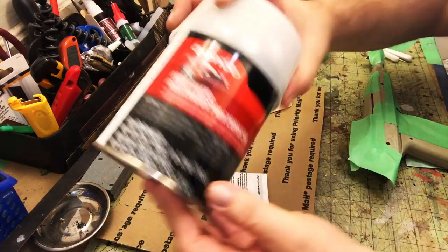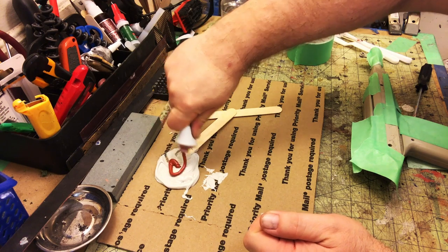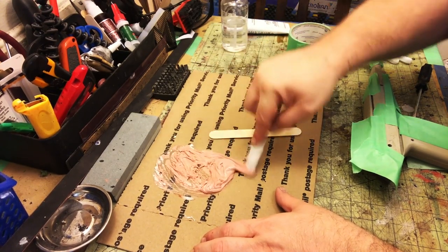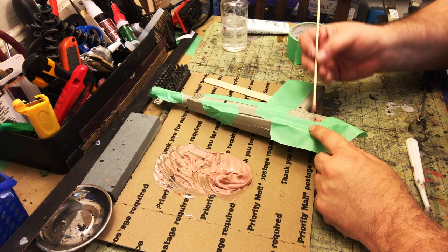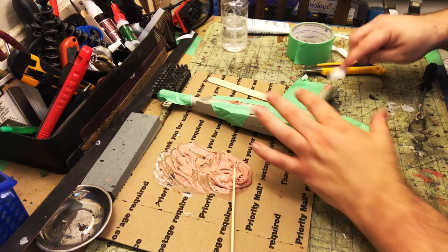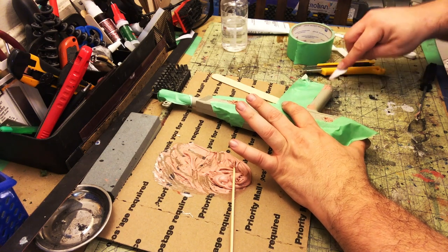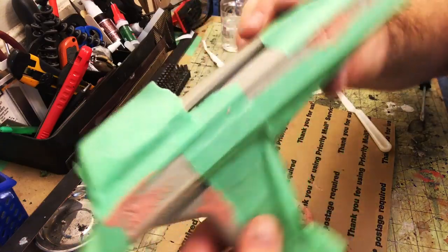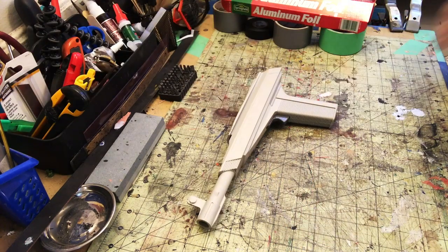Last week I did the pastry chef method; this week I'm going to try skewers. Here's the bondo — you put the kicker in, not too much, not too little, and you really want to work it in there because you don't want a clump without hardener — that's just a bad day. I'm taking the skewer ends to poke the bondo down into the hole to make sure it goes all the way. Then I use these cheap plastic palette knives — they're perfect for getting a nice, even application. I didn't get it everywhere, so that's good.